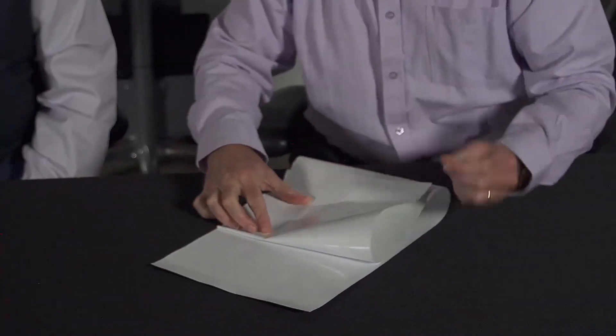What if we did see another cut in the same shape on the second ply and even the third ply? I've seen that many, many times. As Tim said, the problem with that is you're going to be cutting up your cutter protection strip very prematurely. So if we were to see that in this test, we would simply back off — turn this silver component in a counterclockwise direction. That's going to retract the blade; then come back and run that test a second time to see if we get a better result, until we get it dialed in. It might take two or three minutes, but at that point we know we have the proper amount of blade extension calibrated to the thickness of our material.